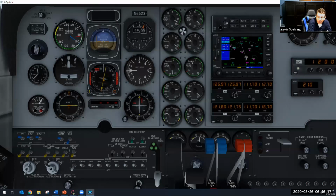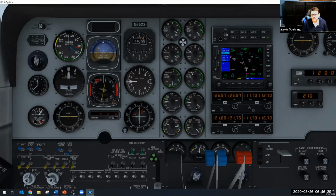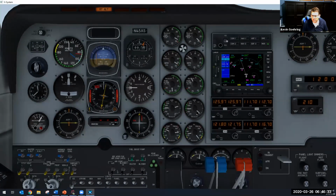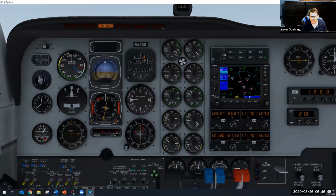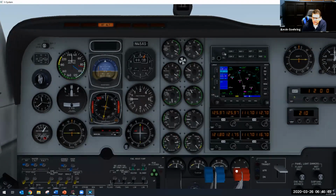And under normal circumstances, I would never abuse an aircraft like I'm doing to this thing right now. Because if you start watching, the temperatures are already climbing up over here, redlining there. This one's going to get way up here. But let me see if I can zoom in just a little bit and still have control. Let's watch our EGT. I'm going to pull back the mixture control. And as I pull it back, EGT should start coming up a little bit, and also my RPM will come up a little bit. The RPM is now at redline, and the governor will actually prevent it from going any further. But watch my EGT, how that thing's coming up.